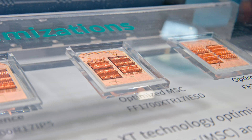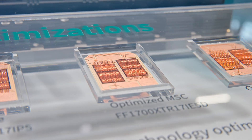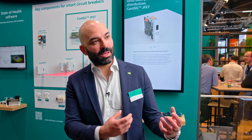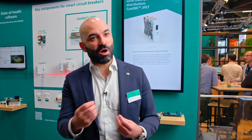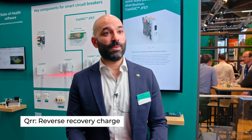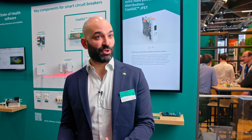You also gain on switching losses even at lower switching frequencies. If you look at IGBT-based drives — and we have wonderful IGBTs in our portfolio, industry leaders with a long heritage — I'm still passionate about wide bandgap. Even in slow switching, you gain because turn-on and turn-off loss waveforms look completely different. In the application, just through the fact that the body diode of silicon carbide has a low QRR, you already get very good efficiency and you're already gaining efficiency points, extending the range of your car.